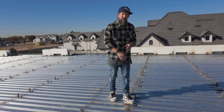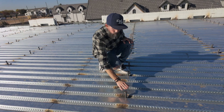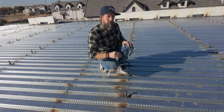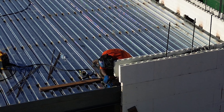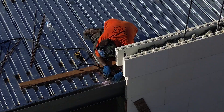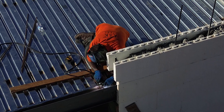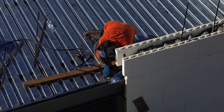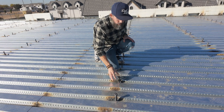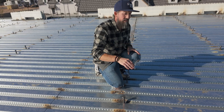Number three is stud welding. In this situation it's actually pretty interesting — when we're welding the studs in place we need to use a stud welding gun. There are loads of skyscrapers and commercial buildings always being built, so it makes sense that they would have a stud welding gun. It creates a clean connection with the beam below the decking and actually fuses it all together in milliseconds.